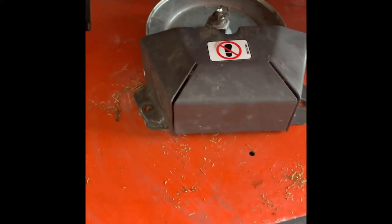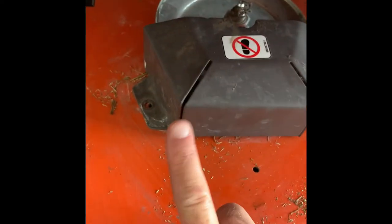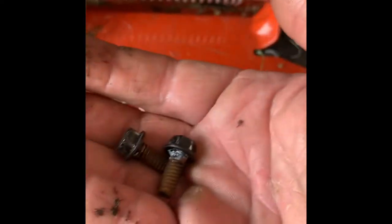You're going to need to remove these mandrel covers. I already took one off. Just take out the bolts — there's one here, one there, and one on the other side. It's a 3/8 ratchet drive. Take them out and put your cover and bolts somewhere safe on the side. The other mandrel cover is just as easy — same two bolts, 3/8 drive socket.